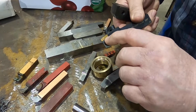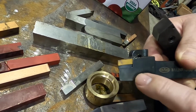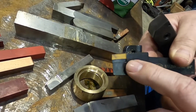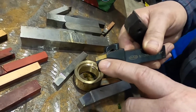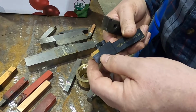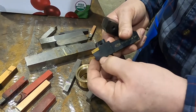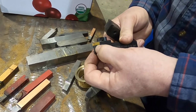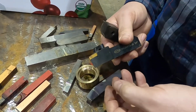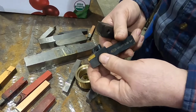And this part underneath the insert is called a shim. The shim is what the insert directly sits on. That is so that you can replace it when you have a crash. Something comes in here, breaks the insert, tears things up, and you can just replace the shim underneath. Usually when it does break up, it will tear up part of the underneath support here, and you'll clean it up and have a little bit less holding it there, but it still works. The carbide bridges it out.